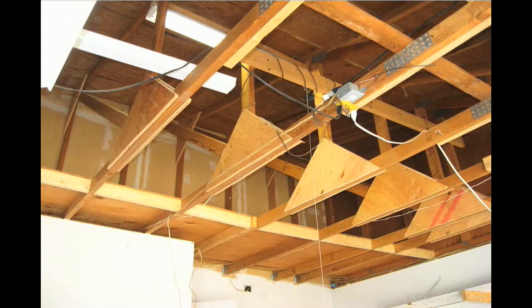The 2 trusses at the left of this photo are bearing on an offset portion of the garage wall, the wall that the garage shares with the living space. A portion of the structural roof load was being transferred to the bottom cords of the trusses at a point at which they were not designed to support a load. Then I walked over and looked more closely at the connections where the trusses attached to the wall.